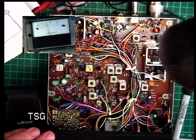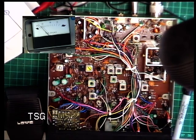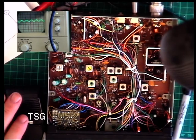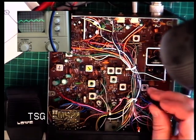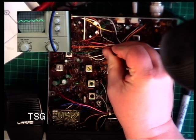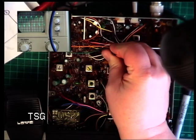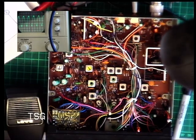And then we'll go to S9 and we'll get maximum recovered audio from the oscilloscope. So I'll just move over to the oscilloscope screen. So we're competing with the radio. It must be on the hour. Oh, it's just coming up to 4 o'clock. The radio's come onto the background music system and we need to adjust L21 for maximum. So there's L21. I'll just move that up to a different sensitivity so it's easier to see. And there we have that. That's set. Good. I think we can lose that camera now.